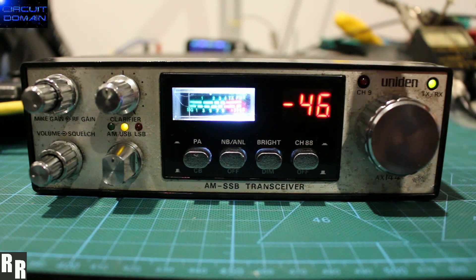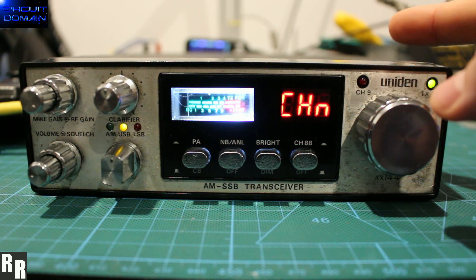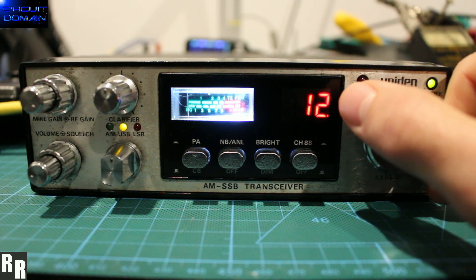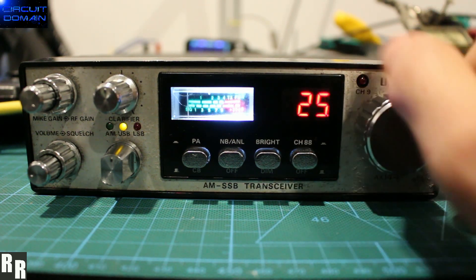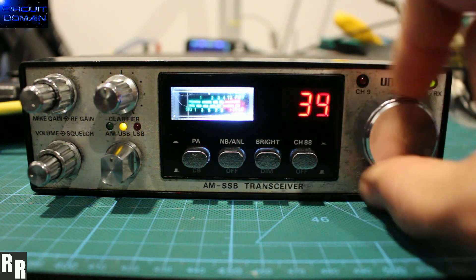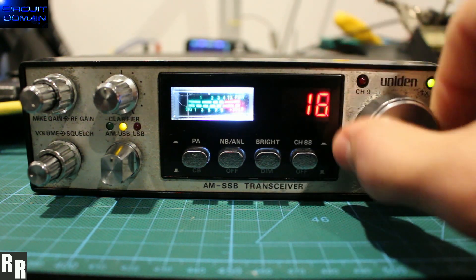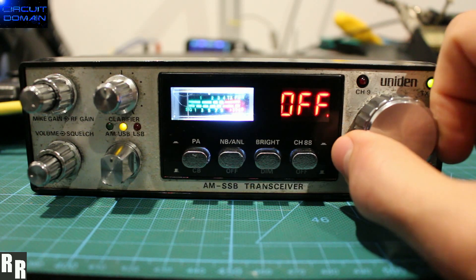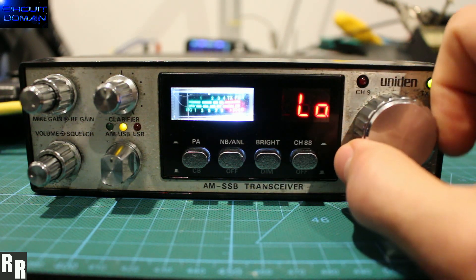Three button presses will be your split RX-TX. You choose how many channels you want the TX to be separated from RX. We had 12 in there set up beforehand — you could choose nine or any arbitrary number. I'm not sure where the maximum limit is, but if you just want some separation you can choose whatever amount of channels you want. Let's just go for nine channels for the sake of argument. You can choose the TX to be either above or nine channels below.